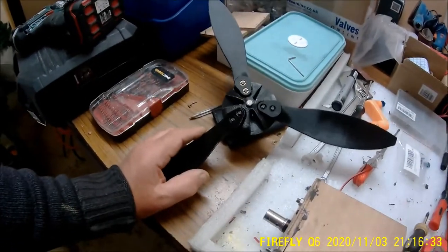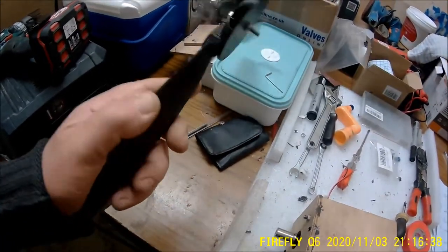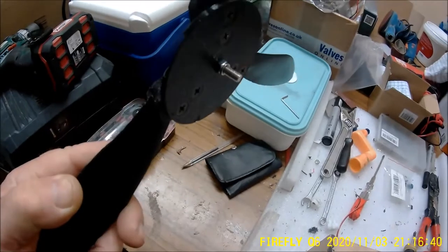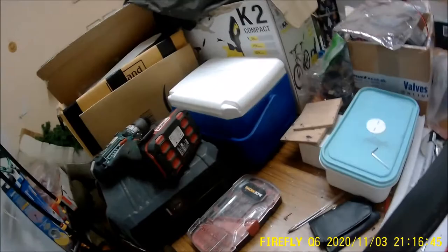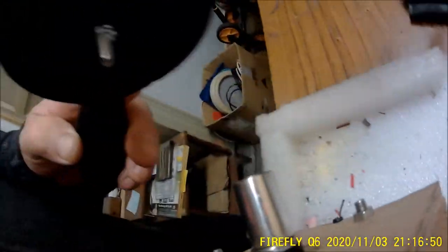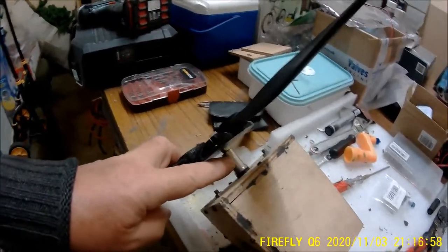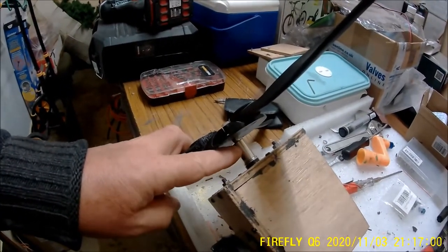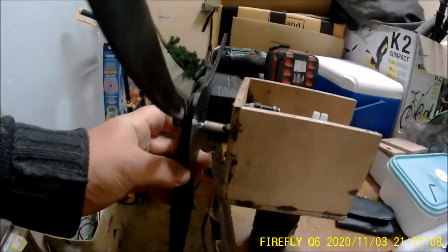You don't need one of these — there are plenty of YouTube videos on how to make your own blades out of PVC pipe. I just stuck a 5mm set bolt through it, flattened one little edge where the grub screw will go, and that will now insert in here. That's my arrangement — that little stub shaft or collet is an 8mm to 5mm grub screw setup. So that's how I intend to attach it — that would be the configuration.